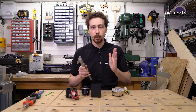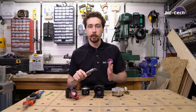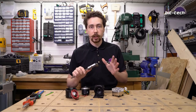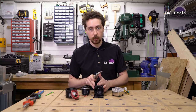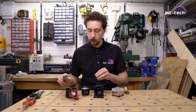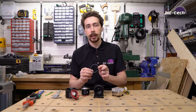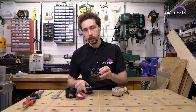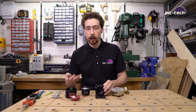I would really recommend using a set of vernier calipers to take measurements. Now if you're a proper machinist you might prefer a micrometer or a depth gauge, but for home use calipers are fine and you'll be able to get within a margin of error that's perfectly acceptable. You can vary by quite a lot and still be completely safe, because the important thing is this o-ring — you just need to make sure it has a tight seal around the pump and that the depths of the impeller and the housing are correct.